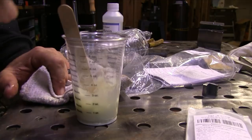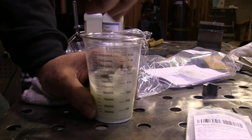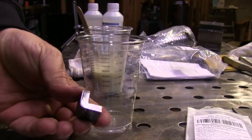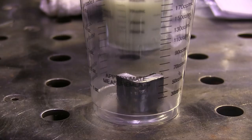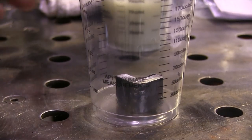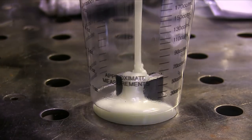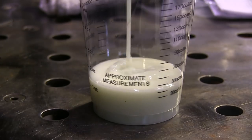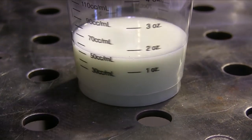To do that I'm going to mount this thing in some two-part epoxy. This epoxy is not designed for metallographic examination — it's just something I could get off Amazon cheaply — and I'm going to lay the piece in the bottom of the cup and pour an amount of epoxy over it and let it cure overnight. Then I'll be able to polish it without the corners hanging up on the polishing wheels and causing a mess.